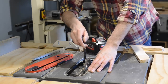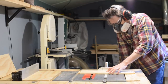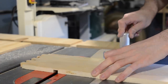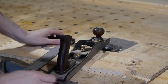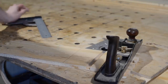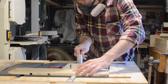With all the joints cut, I swap out the blade in my table saw to my flat tooth grooving blade and start cutting some dados for the shelves to slide into. On the side pieces I draw pencil lines the thickness of the shelves and then nibble away the material. It's a 5mm blade — I start at either end of the cut and take away the centre in three passes. Since I'm not much of a planner, instead of pre-calculating positions I just hold the planes up to work out the shelf heights, draw where the next dado needs to go, take it to the table saw, and cut it. I copy each slot to the piece on the other side, then keep marking and cutting until all the shelf dados are done.